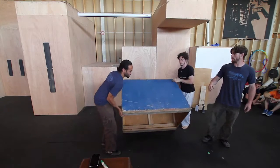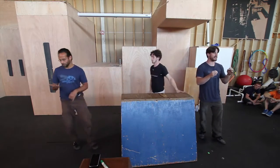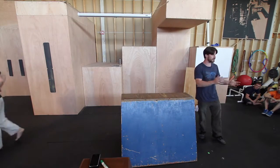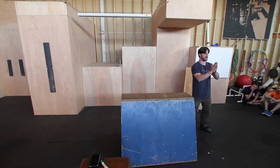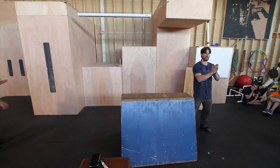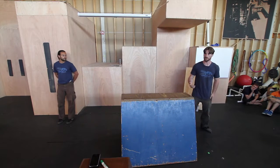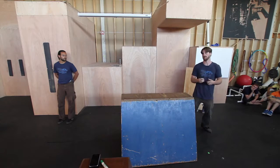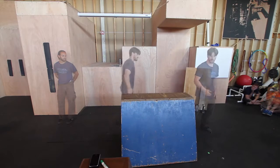And one of the best ways is to clamp it through use of a bolt and a nut, right? If you have access to both sides of whatever it is that you're building or working on, then if you can clamp them together with enough force so that there isn't room for them to wiggle at all right off the bat, then it's probably not going to get to a point where it is going to wiggle over time. Or at that point, your materials themselves might start breaking down, right? The wood that you use might start breaking down. Maybe that wasn't strong enough or something like that.